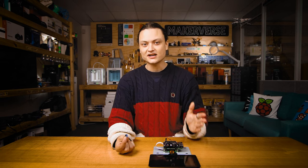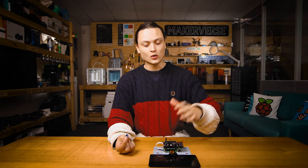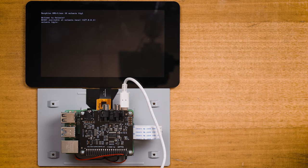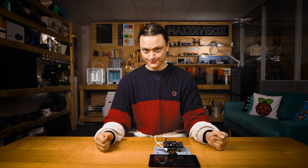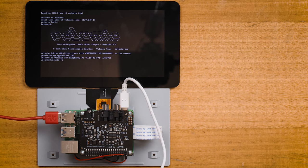Check the description for a guide on how to assemble this screen. Having done that, the screen is going to boot up to the terminal and request a username and password. The username is 'volumio' and the password is also 'volumio'. You won't be able to see the letters getting typed into the screen as they're going to be invisible. After you've typed each one, press Enter on your keyboard to lock it in.